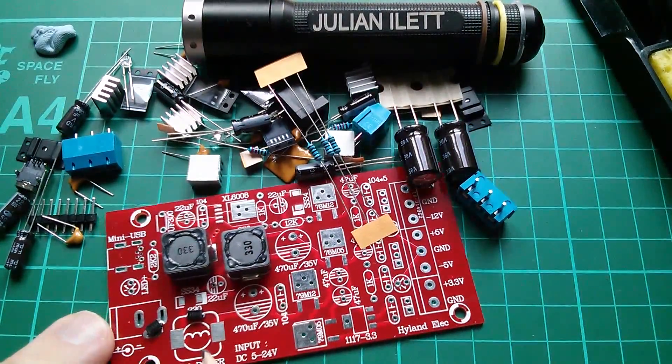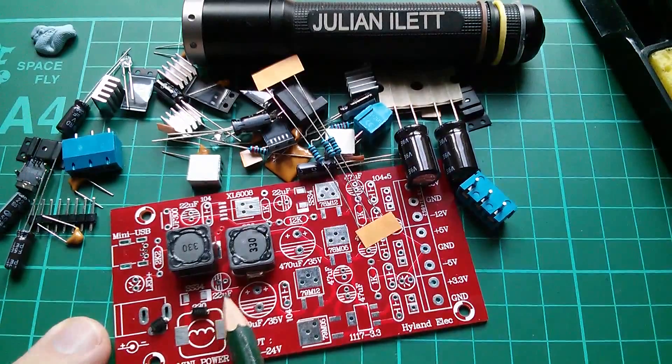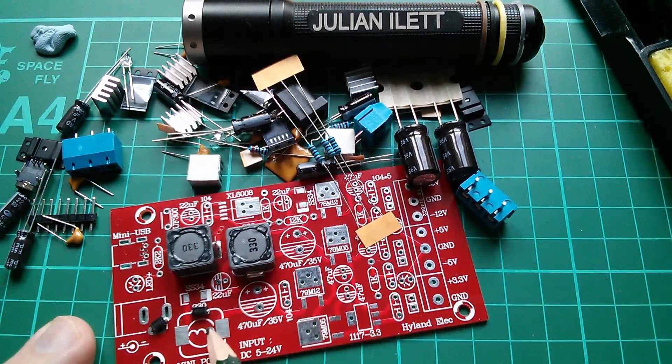Now I've done two of the inductors, there is one more, but there's a diode here between the two inductors. I think that would be tricky to put on with the third inductor in place, so I'm going to put the diodes on now. Someone on the Banggood forums was saying they weren't getting any negative voltages, and they'd actually put the diode on back to front. So what you want is the little bar line — there it is on this one, and it's on the other end on that one, next to the slightly fattened up white line on the board. That's the cathode end marker.